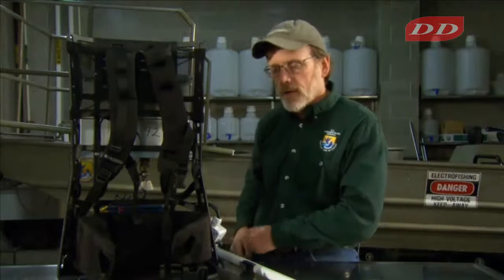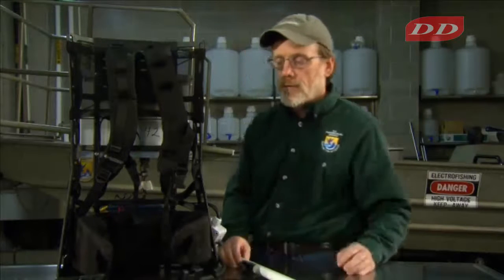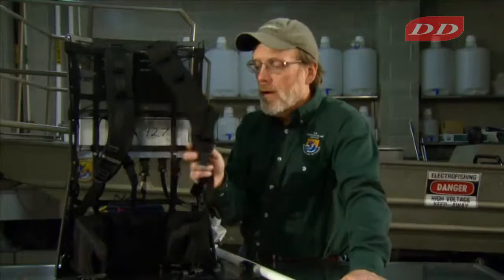And a good thing to do is with your wader belt buckle to move your wader belt buckle behind you, so that if you do have to quickly get out of your unit and disengage this quick release, when you reach down there's no confusion. That's the only belt buckle that's available to you there. It's a good idea though that since these do differ between units somewhat, that you know your backpack straps, how to get it in and out quickly, particularly out.